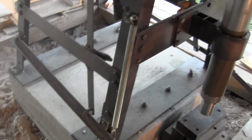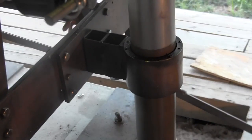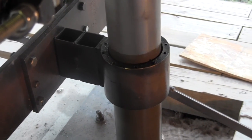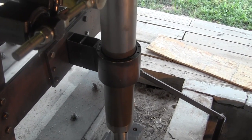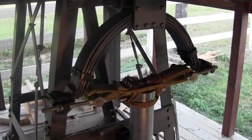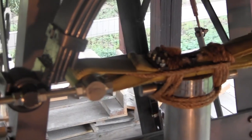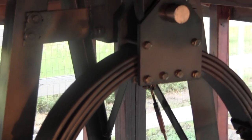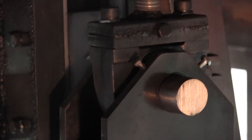Springs are holding up the weight of the arms and the foot pedal. The guide is a piece of bearing bronze that I got from Keith Sturm at KBK — he was kind enough to let me use his lathe to bore out the aluminum bronze he gave me, plus turned the top. A little bit better view of the spring and the strap that goes in between. I had the spring custom made in Dallas.